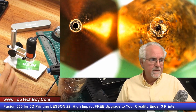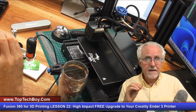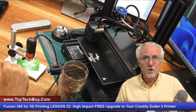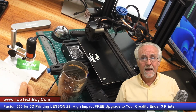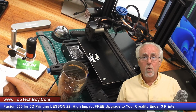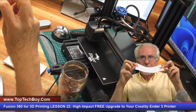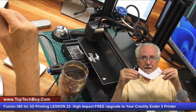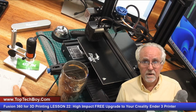Okay. This is the problem that I have with my printer, and from the comments and from looking online, many, if not most, if not all of you have the same problem. These Creality Ender printers often come with a bed that is not perfectly flat, and if the bed is not perfectly flat, there's no way that you can get a perfect bed alignment. My problem, and from what I hear the problem that many of you have, is that the bed is kind of bowl-shaped and low in the middle. I'm not sure if it's like this, or like this, or some combination, kind of a bowl shape like this. But the end result for a lot of us is that the center point is low.